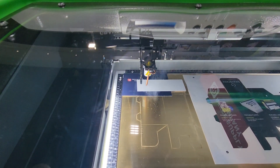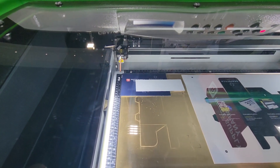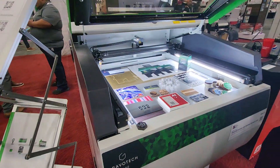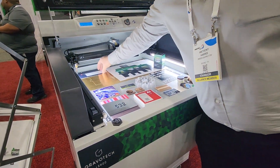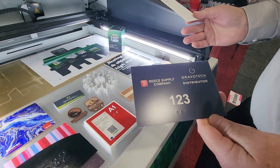It takes about seven seconds. The benefit of the laser is that we aren't concerned with having any chips or adhesive residue left on the sign. It cuts the tactile lettering very quickly and efficiently, and then we're ready to just weed that and we have our finished sign.